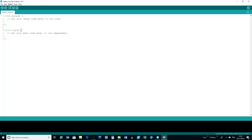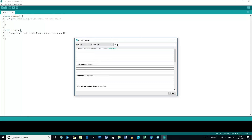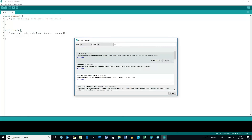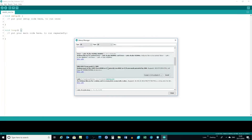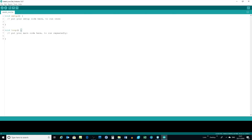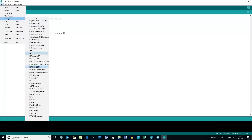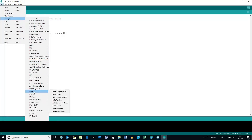In terms of examples, if you go to the Arduino IDE into Sketch Management and type in LoRa long range, scroll down until you see the example I use — Sandeep's library, currently version 0.5. If you choose that one and click Install you'll get the examples, which we can now look at. Scroll down to LoRa and there are quite a few examples, but I'll choose LoRa receive.